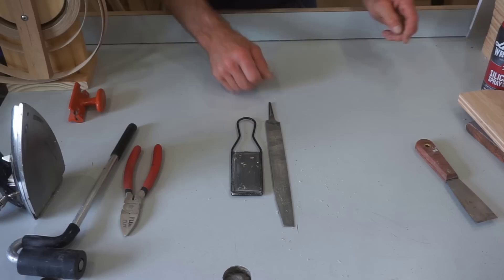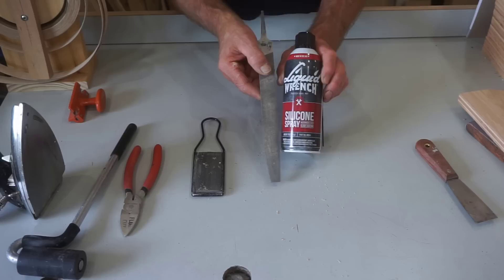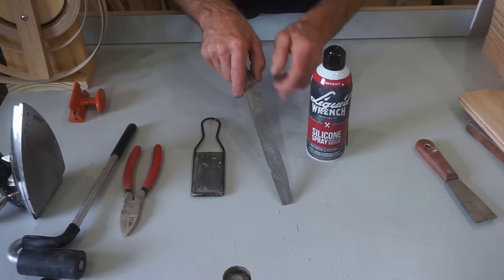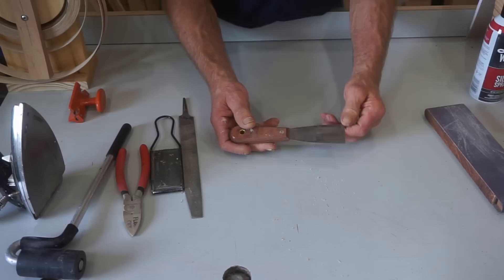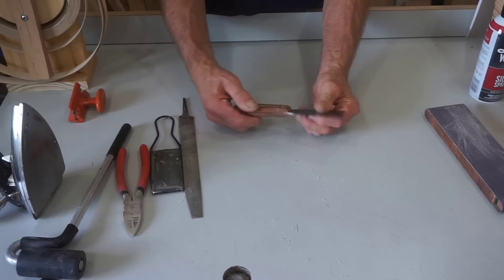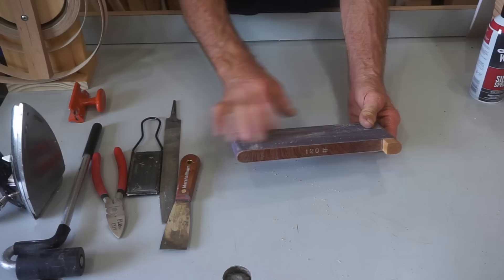The other thing I do with the file periodically — I'll spray it with 100% silicone. This stuff has really got a lot of silicone in it; it's not just propellant. So I give that file a good spritz at the end of the day or at the beginning of a project, and it helps release that glue a lot quicker and easier. Two more incidental tools: I keep a sharp putty knife on hand — you'll see me use that later for cleaning up any residual glue. And last but not least is one of my best blocks for demanding sanding, which is 120 grit, and I use that for rounding some edges and corners.